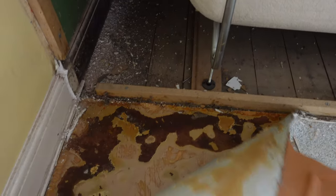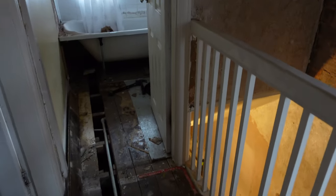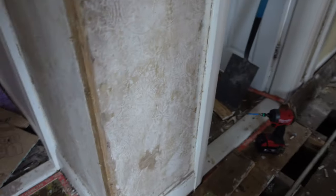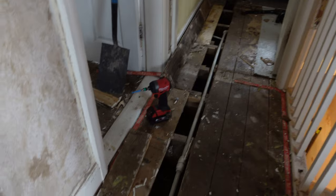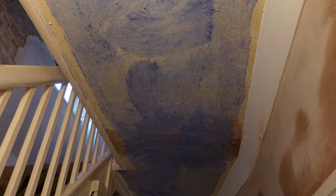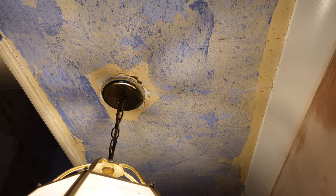Let's get the crowbar out. There's a bit of ply underneath so I'm going to cut with the knife straight down the floor, rip that back and rip it up. The floor is up right the way under the bath — I've taken all the bits of wood out. I've tried the stud buddy downstairs but it's not picking up on anything. So I've drilled a hole through there and I can measure off that hole exactly where our spots are going to be, then go back up and double-check we can get away with it.